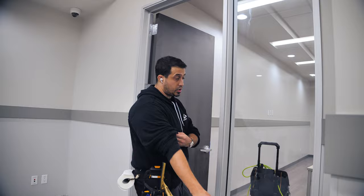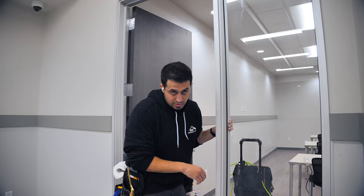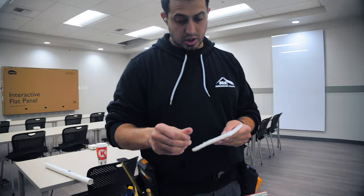Once that's marked, you want to go ahead and clean off the glass. It's important when you clean the glass to identify the type of glazing, because sometimes if you use a scraper you could potentially damage the glass. This is tempered — it's a little bit softer glass, so it is prone to scratching. I'm going to show you how to clean it without scratching.